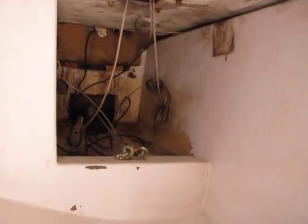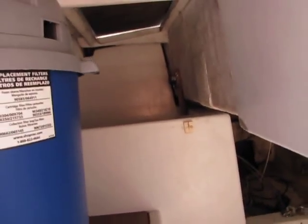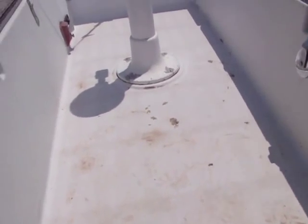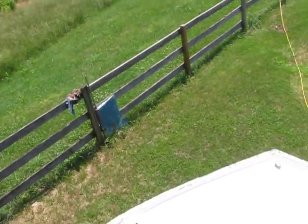Of course, back here, you see all the steering for the rudder has been taken out. I took the rudder out. It's going to need repair for sure. The deck seems solid. The other thing I've got to do here is we've got a really soft floor right here. So I'm going to cut all that out and put some good real hardwood in there. Hopefully solid boards, and make it sturdy. Other than that, seems to be doing pretty good. It's coming right along.